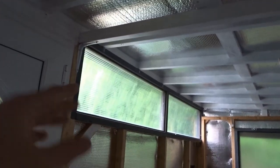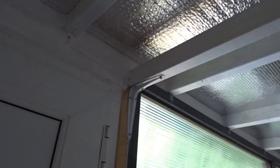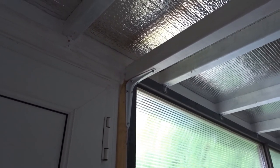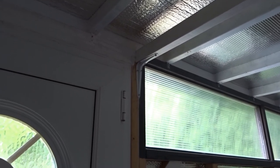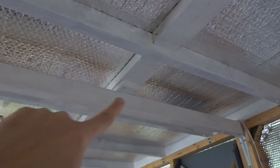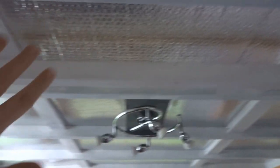In the middle of the frame — we've got one eight-foot section and then another eight-foot section — at the weakest point I've used another 2x3 with just a shelf bracket holding it in position. It's not structural, the shelf bracket just keeps it in place, stopping the frame from falling in on itself at the weakest point. It's also touching along the tops of these noggins, giving a little extra strength at the weakest point of the roof.